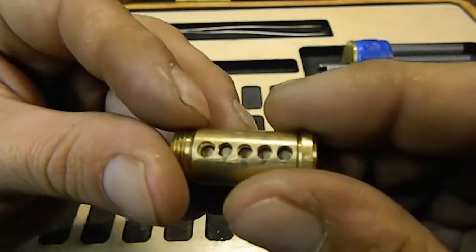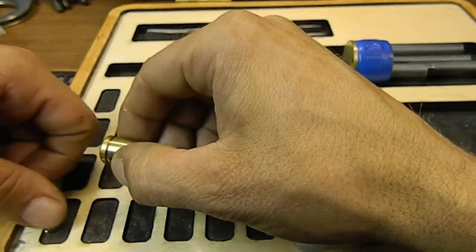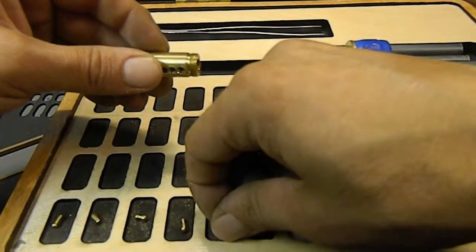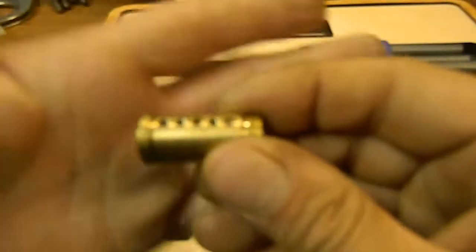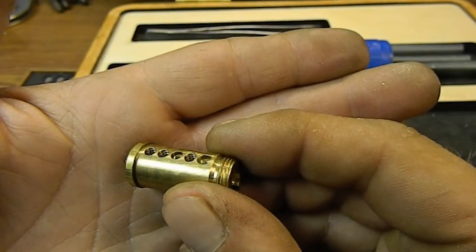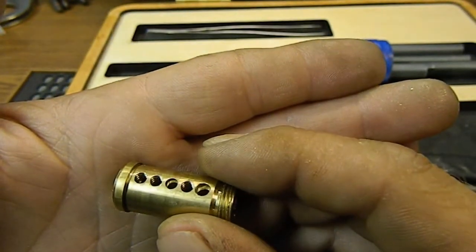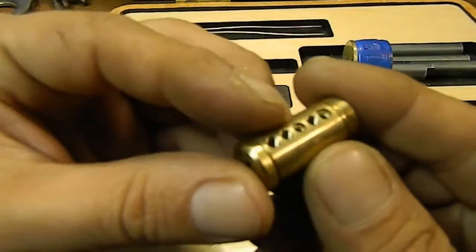And everything was pretty deep — needed to be picked. That's good fitting when you don't have anything sitting right at the shear line; makes it a fun pick. Nice, sharp looking pins here — very well serrated and T-pinned and spooled. Looks like we have threading in one, two, and four, and counter milling in three and five. Which is what I had said — that counter milling in five was what I ended up catching on and had to open it up on. I think about halfway through the pick I got caught up on the counter milling in number three. Awesome stuff there man, great work on this core.